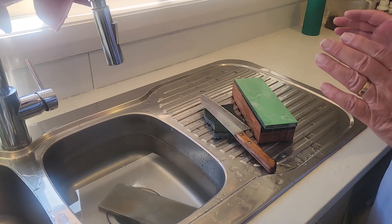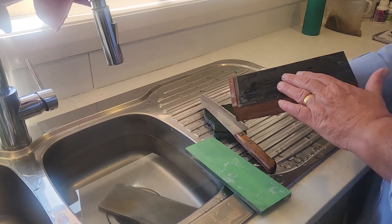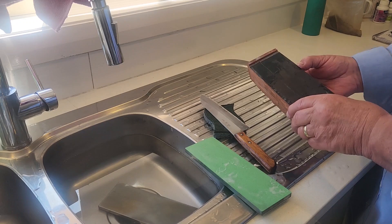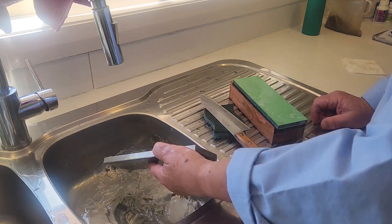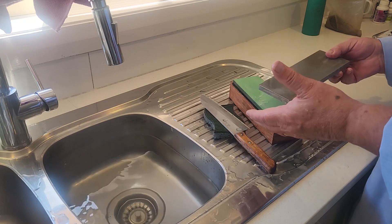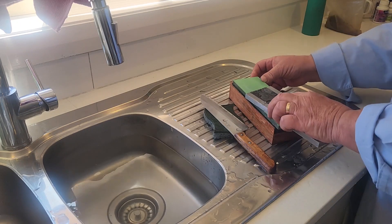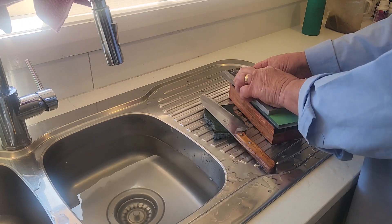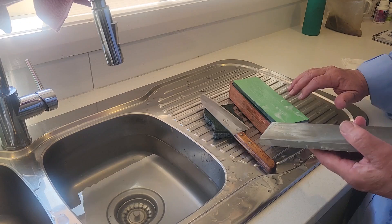Let's go down to some sharpening. This is my own setup — just a block of wood with some anti-slip tape on both sides so it doesn't move on my kitchen bench, with a little ledge on the end to stop it from tipping over. Here's my Naniwa 400 grit — I love that stone. My Atoma 400, and I've also got a 140 for coarser stones. As I said earlier, you do not need a diamond stone — you can just walk out your back door and start cleaning up your stone on concrete. All you're doing when flattening your stone is getting an even distribution of bubbles and stone residue.